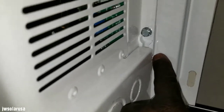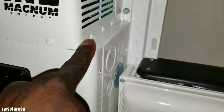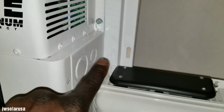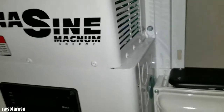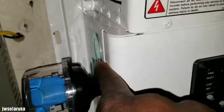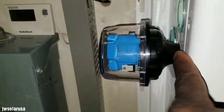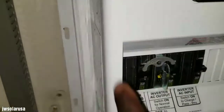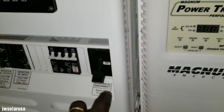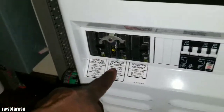This panel flushes all the way and sits exactly here — look at the leg. The wire is going to shoot right into the conduit knockouts. I want to stay away from the AC side and come onto the DC side so I can tap onto the DC input breaker, then route the wires back to the AC side.